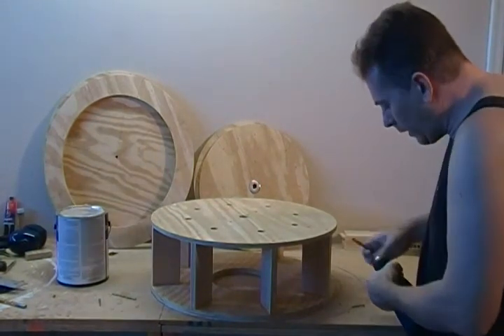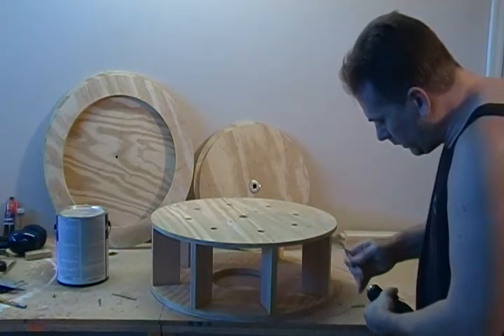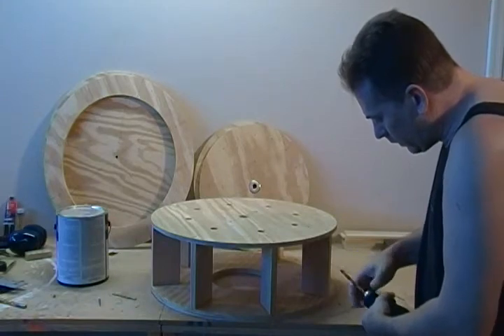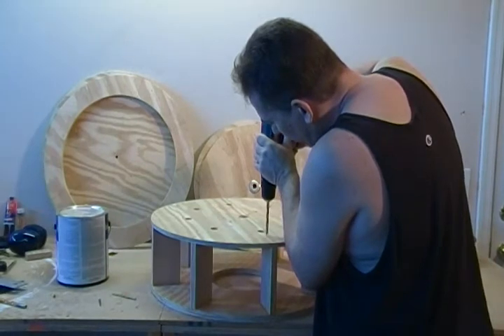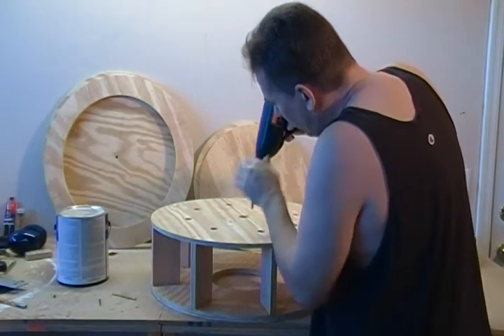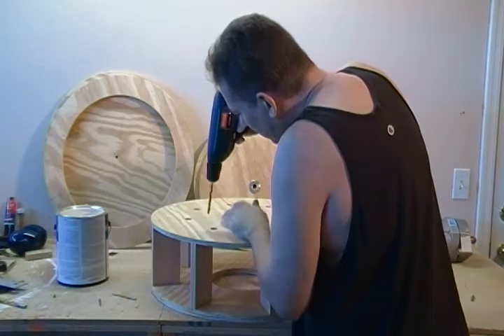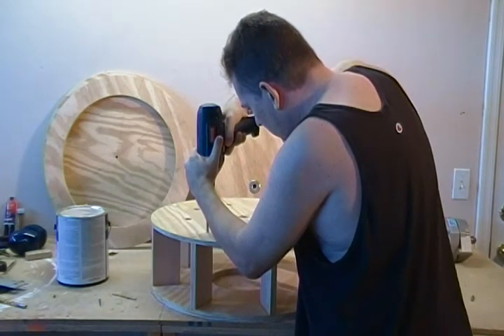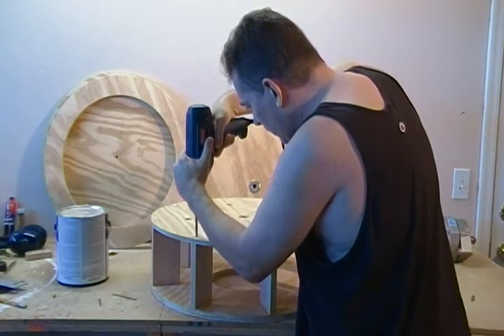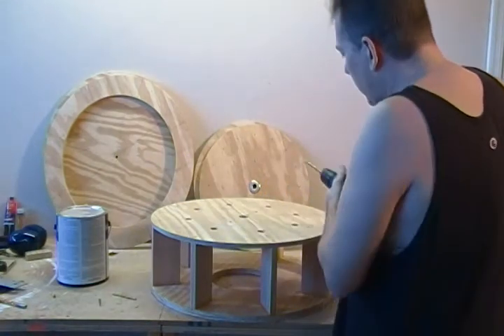What I'm doing is I want these deck screws to be completely flush. I'm going to putty over them and hide them forever. I'm taking a 5/16th drill and just putting a little countersink, very gently into each of these holes, top and bottom.